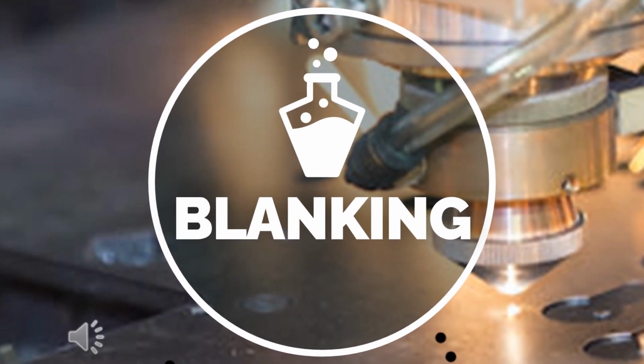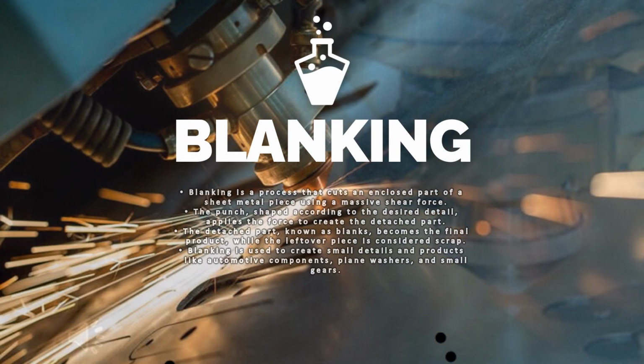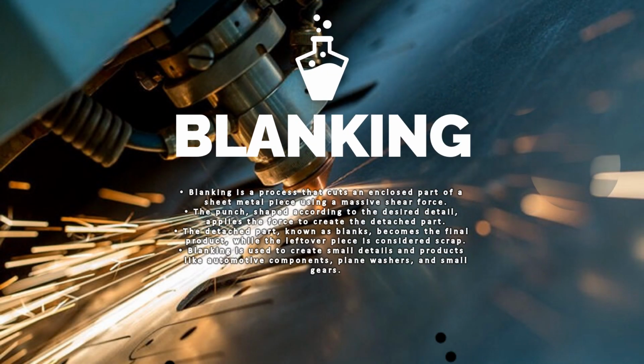So let's proceed to the next one, which is blanking. Blanking is a process that cuts an enclosed part of a sheet metal piece using a massive shear force. The punch, shaped according to the desired detail, applies the force to create the detached part.